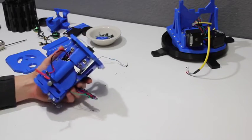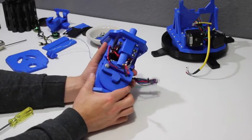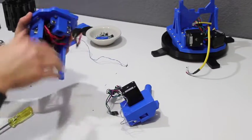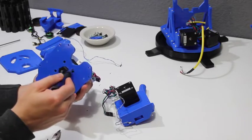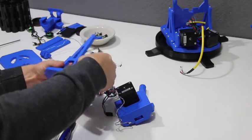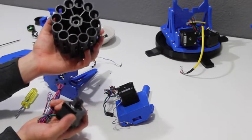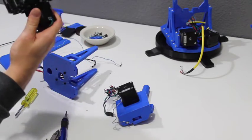Let's pull this back plate off. With those screws all out, just pull this whole piece out like that, and then you are left with just the plunger and the motor, the back plate, the rear braces, and the plunger guide. I'll go ahead and take this motor out of the back plate. On the front of that motor you'll see this hexagonal adapter — on the back of the revolver piece there is a mating piece that slides into there. That is how it turns; it's actually a direct connection.